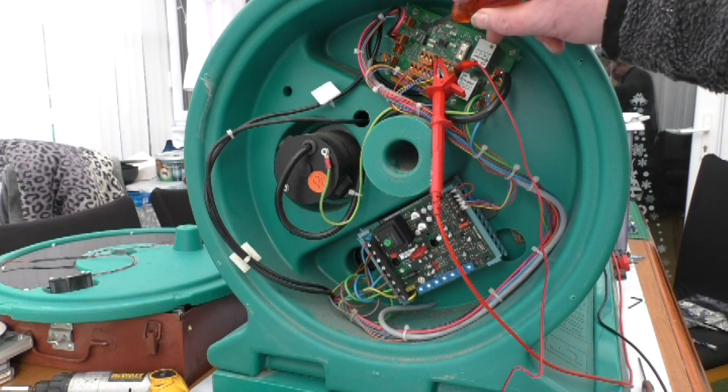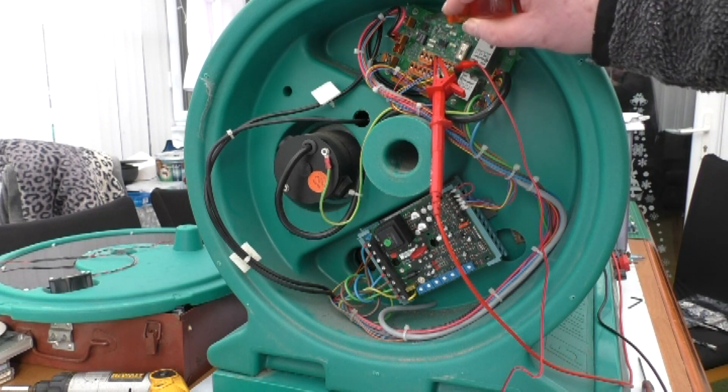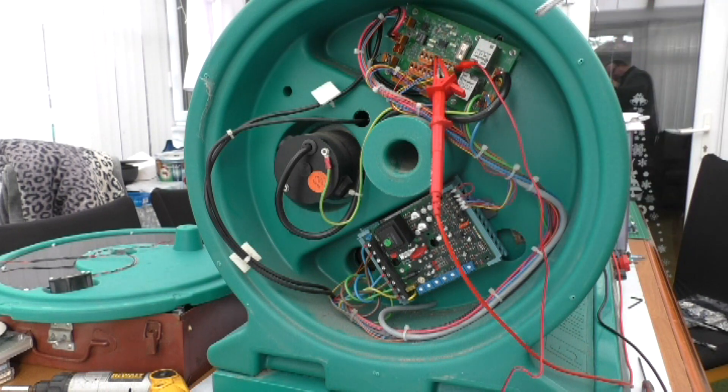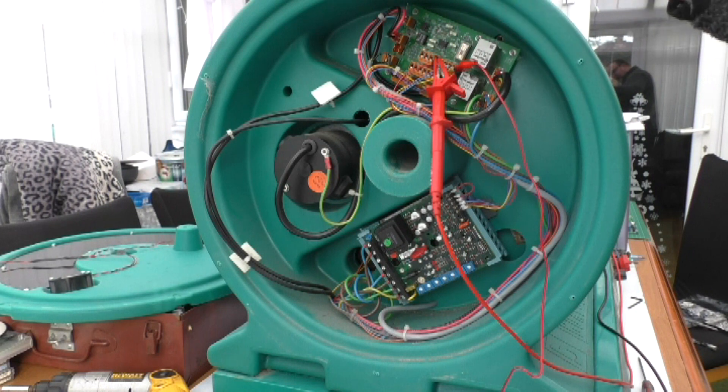A word of warning: after the DC-to-DC converter and this opto isolator for the PWM signal, this part of the board is totally floating with no reference to mains ground. I mistakenly put my oscilloscope probe where my meter was, and the second I turned it on my RCD tripped — no damage was done. Didn't really think about it, but these things happen. Just a word of warning about that.